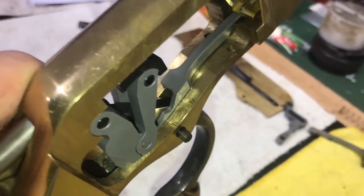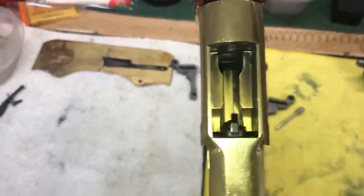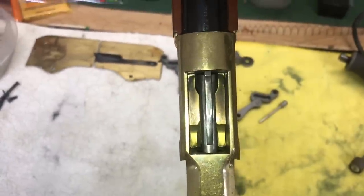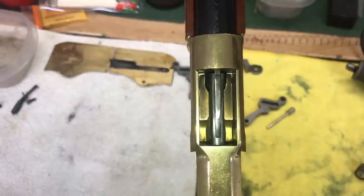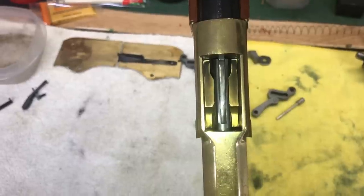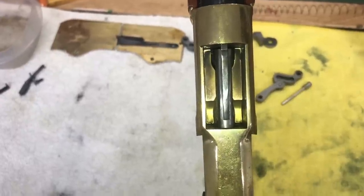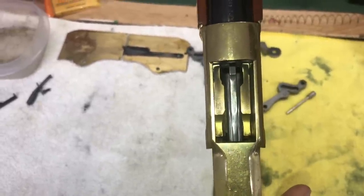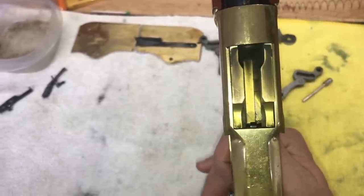We've got the kit installed — not properly timed yet, but we're going through the process. We've already taken ten thousandths of an inch off the lifter arm. Now I'm going to take the lever — lever's free — and throw it forward. We're going to watch the bolt retract as the carrier comes up. If the top of the carrier touches the bottom of the bolt as the bolt is retracting, before the bolt has a chance to retract fully into the frame, then the timing is not yet complete. We need to continue removing material from the underside of the lifter arm, ten thousandths at a time, until the bolt face and the top of the carrier on its upward travel barely miss.